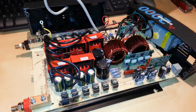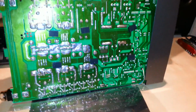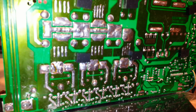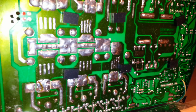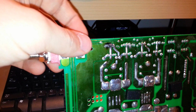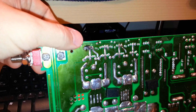And if I can, I'll move the camera here a little bit to show you the underbelly. Alright, well here's the underbelly of it, and as expected, those big solder blobs are actually where the fuses are, so it doesn't look too insane to get those out of there, but it will still be a little bit more operational work to get them off. I think that's just more annoying. They really should have those socketed. I'm not going to be able to focus this too well, guys, because it's so close. I probably need to get my macro lens, but that's where that particular FET failed.